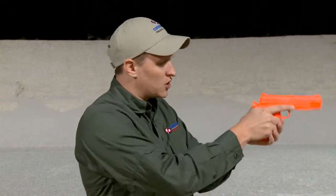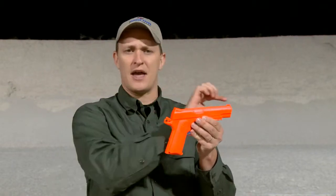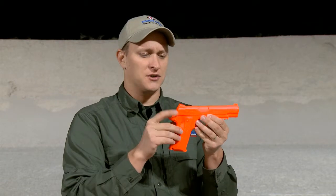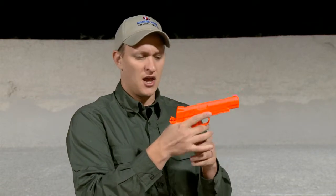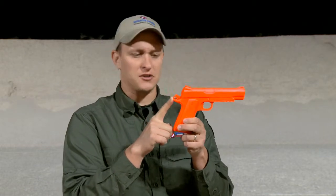Even the cylinder would rotate, and that's fine. But the muzzle and the bullet, everything exited at that one end. And that meant that as long as you could lock everything down on your grip, you'd keep the muzzle down. That wasn't necessarily the case anymore with semi-automatics, because all this top-heavy action moving up here as it fires creates cantilever effects, which is why they added what's called a beaver tail back here.